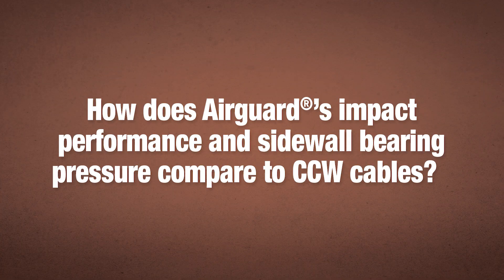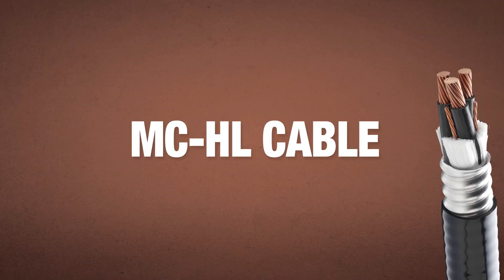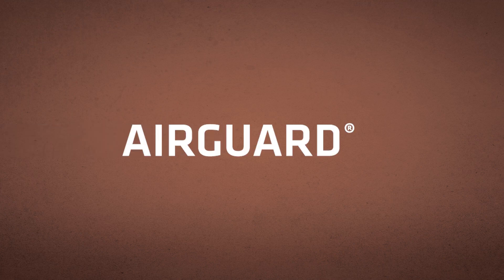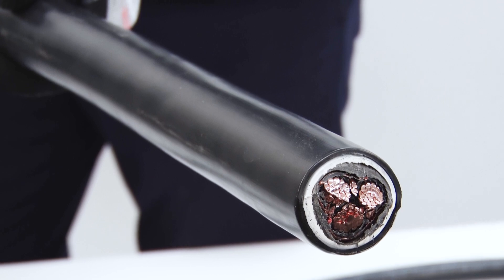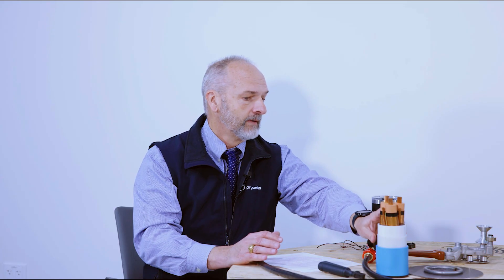What would you say is the difference in construction between the MCHL versus AirGuard? MCHL has been around for 40 to 50 years — a good product. However, with AirGuard, we really leapfrogged from a technology standpoint. MCHL cable is essentially an aluminum tube that's been corrugated, and the conductors are pulled through with fibers and strings to fill the gaps. With AirGuard, instead of fibers and strings, we use a rubber compound that completely fills the interstices of the cable. So you have a solid, round, concentric design.